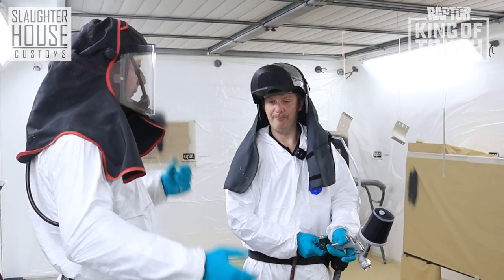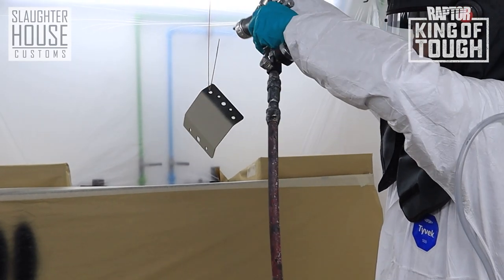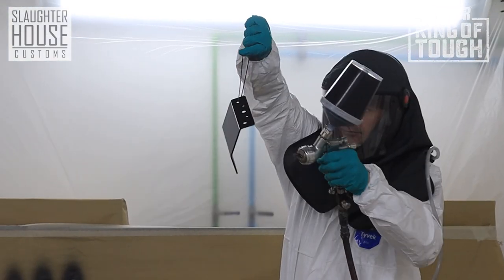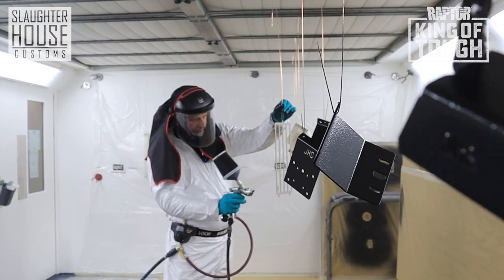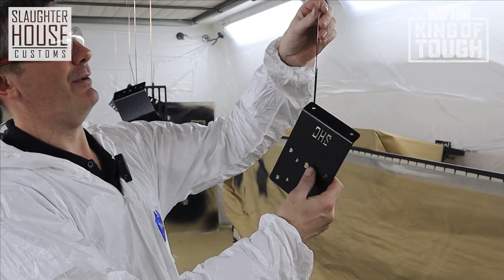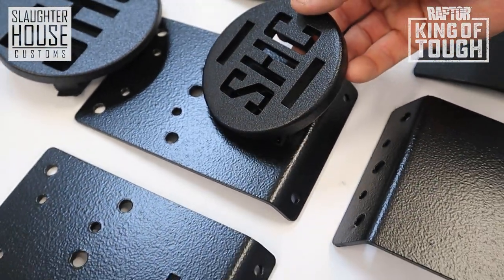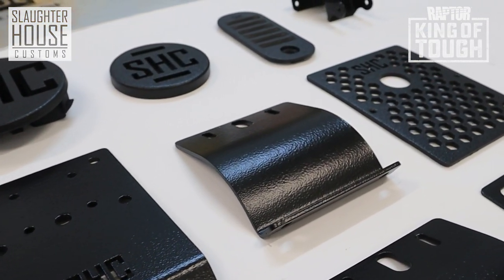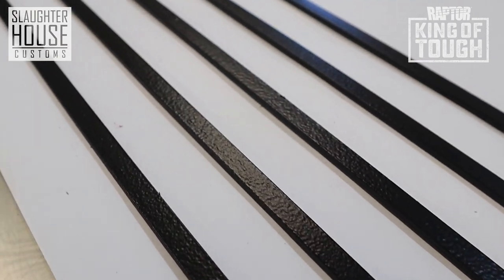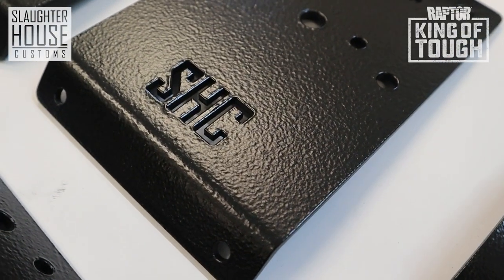We're going to set the gun to two bar, kick the groove on and away we go. Job done — 30 minutes later, cooled down, nice and dry, nice and handleable. Let's take them out and have a look. Two different textures there, purely by changing the tip size of your gun and a little drop of thinners — you can really see the difference you can achieve. Anything in between also, just by tweaking your pressure and distance. Make it work for yourself. Raptor is very user friendly, really easy to use. Look at that — even on the stainless steel, sealed really nicely around the edges, everything coated, just giving you that extra layer of protection.